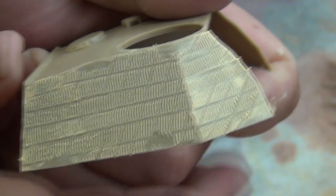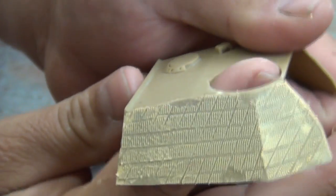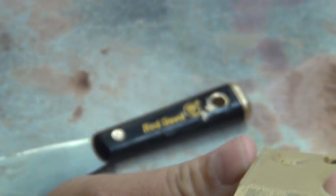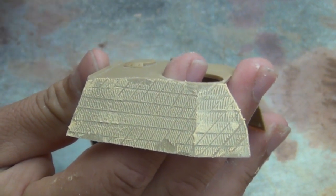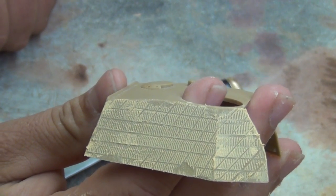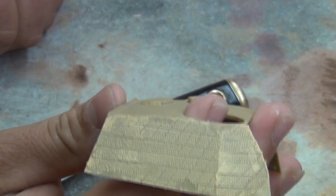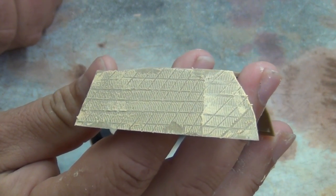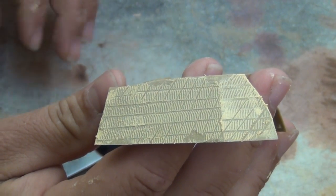And I think what we would normally call this done, and I guess I would let this dry overnight. It should dry fairly hard, harder than I would think like a drywall compound or something, because this is a wood filler. So I would let this dry overnight and go ahead and prime it, and I think you're ready to paint.